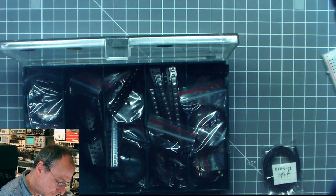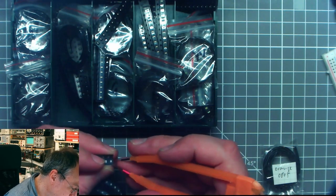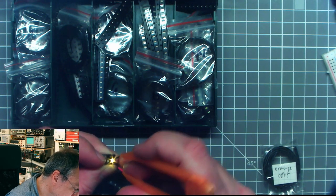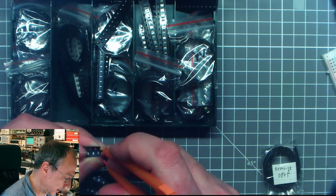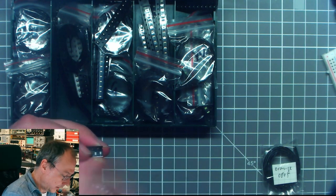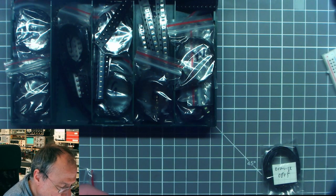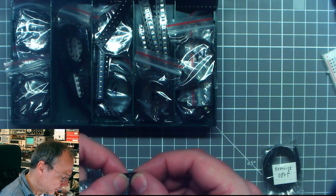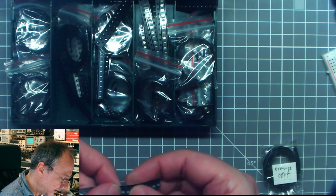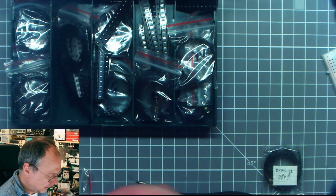So let's see how yellow they are. I have my LED tester here, which can actually pinch through the plastic foil of these strips. And yeah, this is a nice strong yellow LED. Since it is a multiplex system, strong or intensive LEDs are preferable. So what did I say? I need 4 plus 2, 4, 6, 8, 10, 12 LEDs. Oh, 13, the top, the blinking one on the top, also yellow, like this.